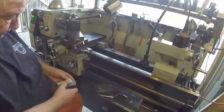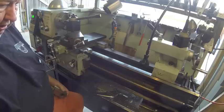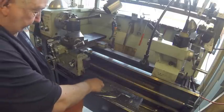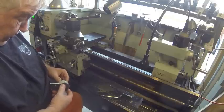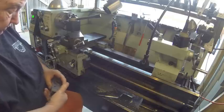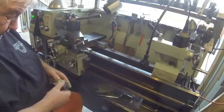So what we've got to do here is take the end off the lead screw. Just two bolts and it'll come off. Then I can slide this on and we figure out the orientation to drill the nipple out. I'm pretty sure that there's a spot right in that area that it'll work fine. So maybe I'll just go ahead and drill it out first, and we're done with it.